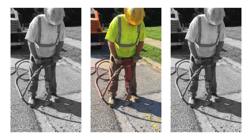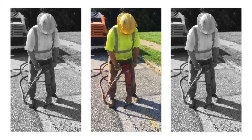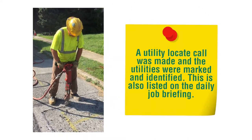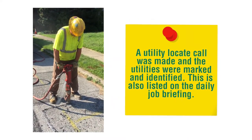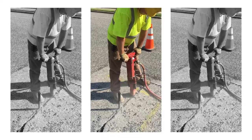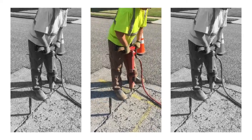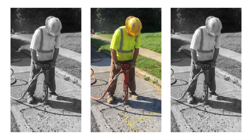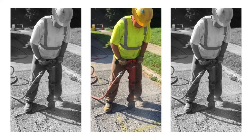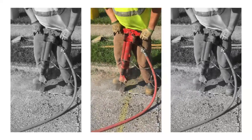Operating a jackhammer requires practice. Here is a jackhammer operator scoring and cutting a line using an asphalt spade — the operator makes it look easy. Note that a utility locate call was made and the utilities were marked and identified, as listed on the daily job briefing. Let the jackhammer do the work. There is no need to lean or force the jackhammer into the material you are cutting. A light but secure hand grip is all that is needed. Failure to hold on to the jackhammer can cause it to fall and strike your feet or other objects. Always keep your feet out of the line of fire.